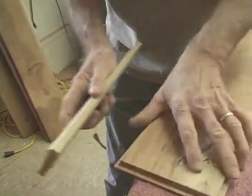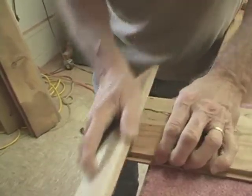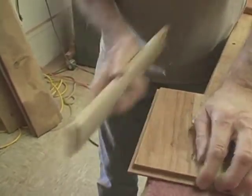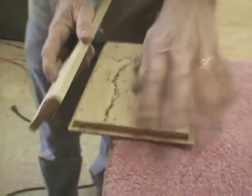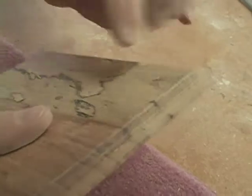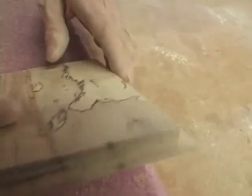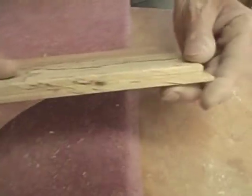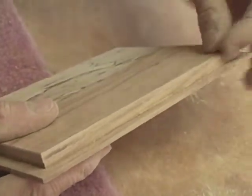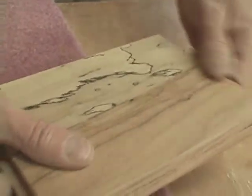That was four. Count inside your head and just try to apply it evenly. So that's not a real dramatic effect, but it certainly will soften the kind of touch that you get from it — instead of touching it and feeling a really crisp edge. Hopefully it will be uniform all the way around. Sometimes the end grain and the side grain will sand differently, but I think this is going to work okay.